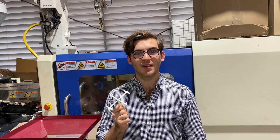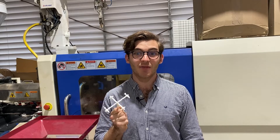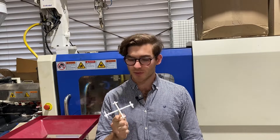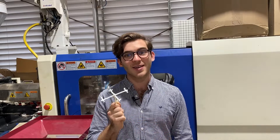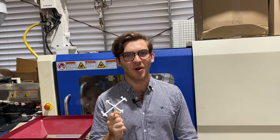What this ultimately means is that if your tool has a cold runner system, the plastic in that passageway will solidify every time the tool cycles. As a result there is a small amount of wastage called a sprue and a runner. At Dynamics this wastage gets collected and recycled back into the product with plastic regrinders and vacuum loaders.